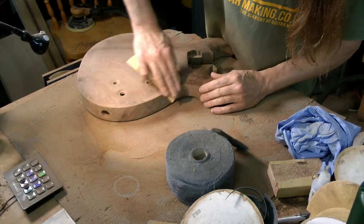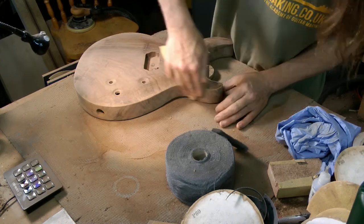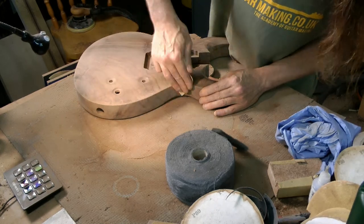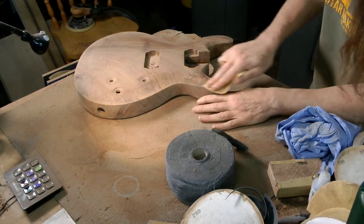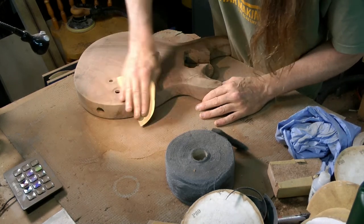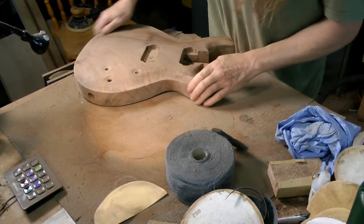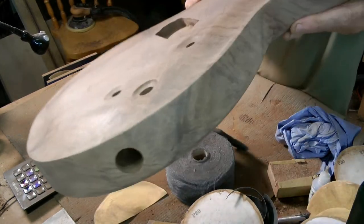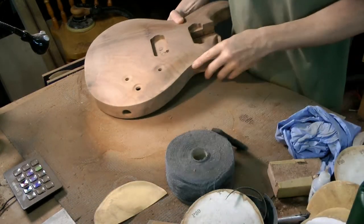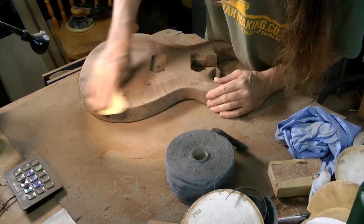we just round this edge off all the way around. So sand it as if it's a chamfer and then knock the line off the bottom. Knock the line off the top. Parallel to the centre line, and you get this kind of, it's not a sharp edge, but it's not rounded either, so it's kind of like a hand-finished sort of edge, just to take the worst of the sharpness off. You can round that off as much as you want, or as little.